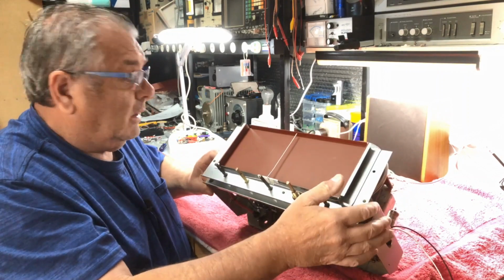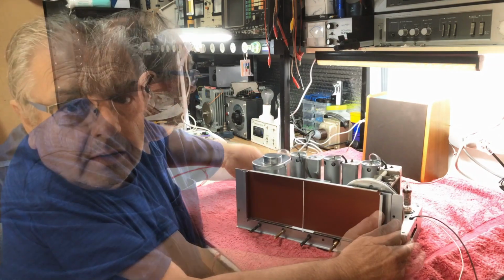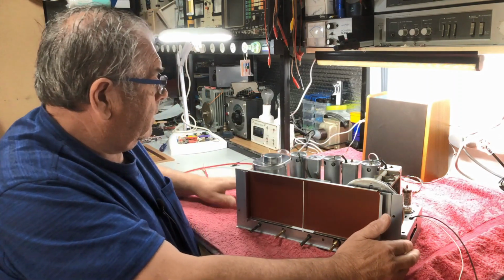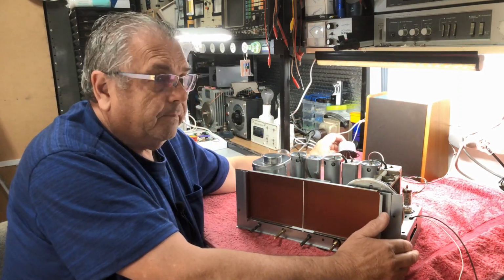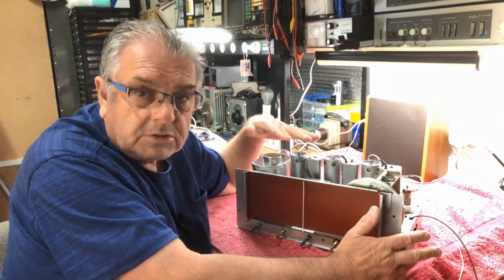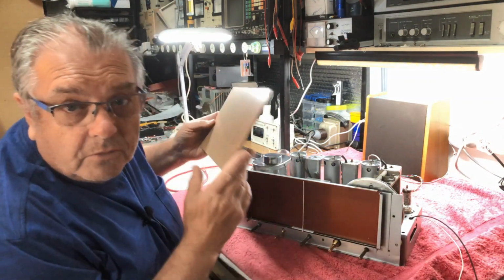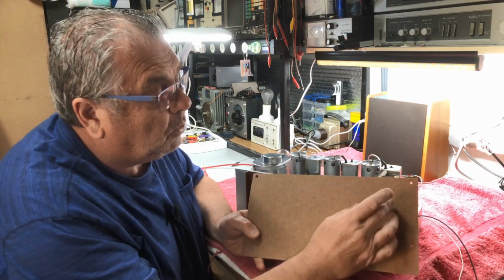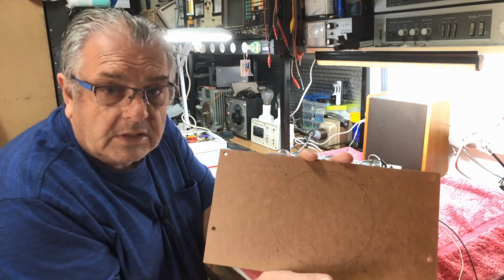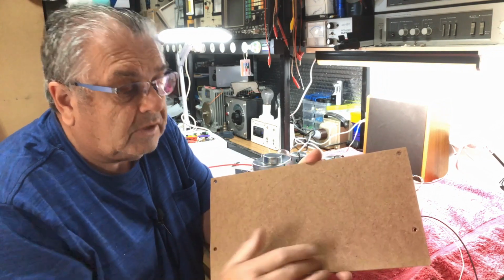So our next job is to put him on the signal generator and plug in our audio transformer to our speaker over there. The audio transformer, which is that fella, was mounted on the old speaker. Now, the old speaker was totally shot. We're going to have to replace that. We'll mount the transformer separately, possibly on this board. This is the speaker mount that goes in the top of the radio. I have to cut this out yet.